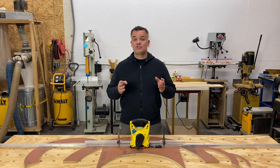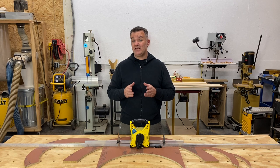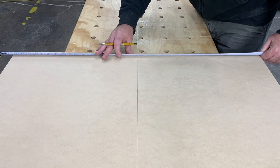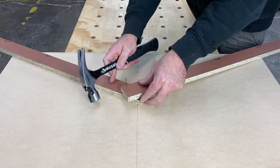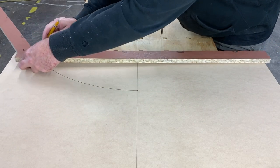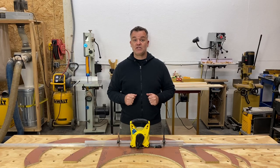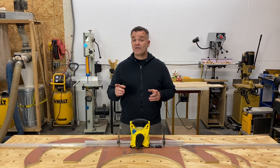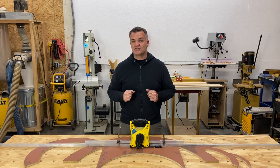Now there is a third method using three nails and two sticks to draw out the arch. In this method you're not concerned with the radius, but there are some limitations and the way it's normally done lends itself to some inaccuracies. This method can be useful on small to medium single arches by using less footprint. If you're interested in improving your two-stick method, I'll be making a video on that, so hit the notification button.